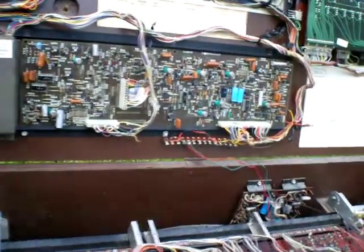This is a version that has a bunch of CA 3080s. I've got to insert a little correction here. I was talking to somebody who is quite an expert — a woman who had worked on quite a few of these organs and the Moog synth part. There are at least three versions it seems, and I have two schematics. This one looked like the closest one because it has the CA 3080 units on the board — there's one right there with eight pins, visible in the middle of the screen.